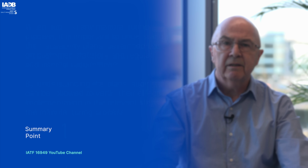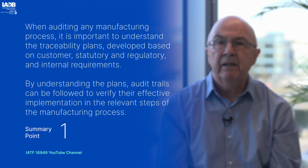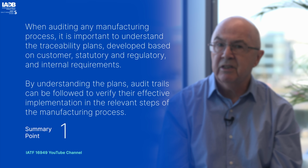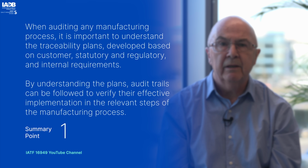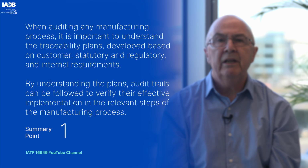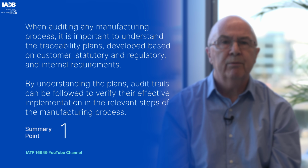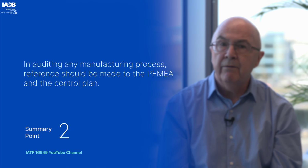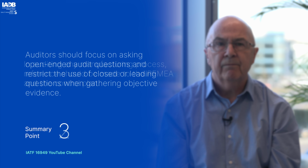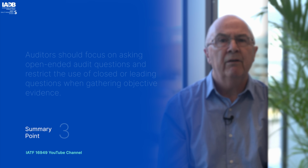So let's summarize. When auditing any manufacturing process, it is important to understand the traceability plans developed based upon customer, statutory and regulatory requirements, and also any internal requirements. By understanding the plans, audit trails can be followed to verify the effective implementation in the relevant step of the manufacturing process. In auditing any manufacturing process, reference should be made to the relevant PFMEA and control plan. Auditors should focus on asking open audit questions and restrict the use of closed or leading questions when gathering objective evidence.